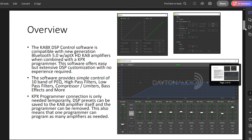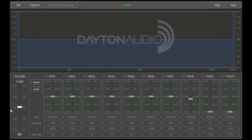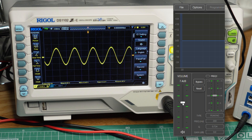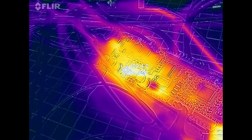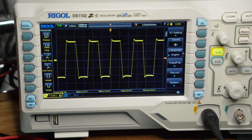This is the Dayton Audio KABM software, used to control the DSP settings. Notice that volume slider? By default it is set to 6.3dB, but it can go up to 12dB. By boosting the volume through the DSP, I was able to get more power out of all of these boards. The highest amount of clean power I measured was 8W with a 16V supply, but at this point the amplifier was starting to get toasty. Out of curiosity, I pushed the amp beyond clipping and managed to get 14.6W per channel, but that is just not usable power with all that distortion.